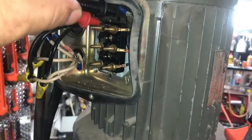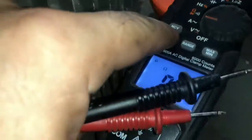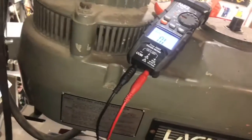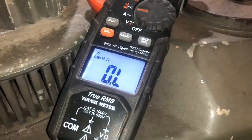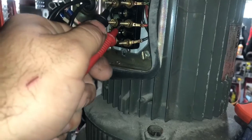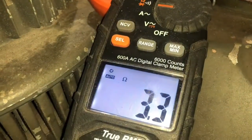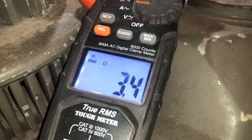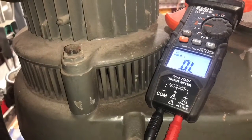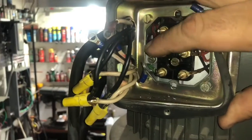Let's go ahead and check them all to ground real quick. Nothing to ground. Now we're gonna select and read the resistance. So this one wasn't reading — we got nothing. The next one reads four ohms. The next reads three point three. Then going across, three point three. And then this last one — we got nothing.